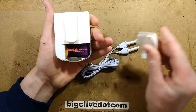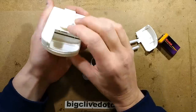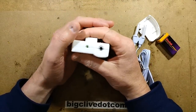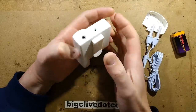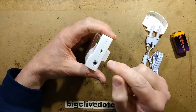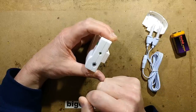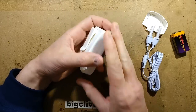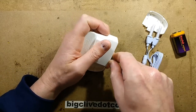Let's make our guesses about what's inside this unit before I spudge it open, because I don't see any screws — it might be glued shut; if so it's going to be violent. I would have thought maybe a very simple timer circuit like a 555, running for a set time — when you push the button it might charge a capacitor and when it drains below a threshold it goes off. But now I see it detects the missing LED and starts flashing, so I'm wondering if this is a little 8-pin generic chip. There's only one way to find out.